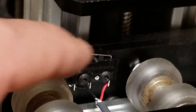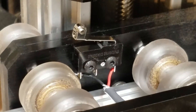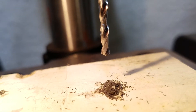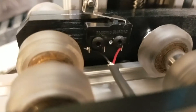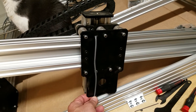The other thing I had to do: the through holes in these limit switches are just a little too small to have an M3 screw go through them. So I had to drill those out, and you have to be really careful because these switches are made of a real hard, brittle plastic. I used a 3.3 millimeter drill bit — nothing fancy — on my drill press. If you try to do it with a hand drill, you're going to break the switch. Very slowly, very carefully drill out those holes and then everything's fine.